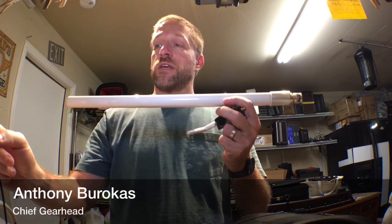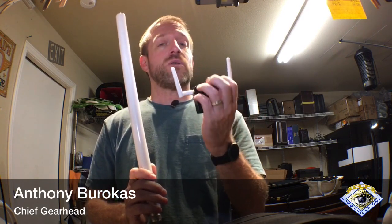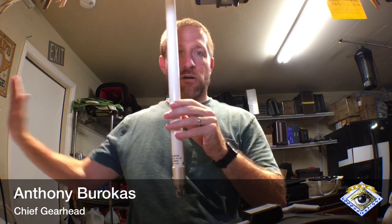These are actually outdoor antennas that you can use. The advantage to using a big antenna is that your signal will be louder than competing signals, because you can only turn down the loudness or strength of your transmitter. These are limited by law to about one half of one watt. But one half of one watt into a tiny little piece of metal versus one half of one watt into a high gain antenna makes a big difference. You're not changing the output power of the radio — you can turn it down in software, but you can't legally go louder than that transmitting power.